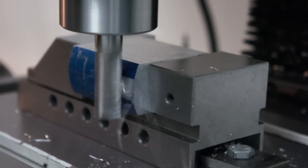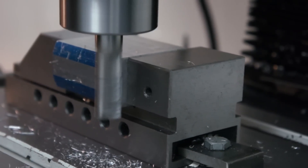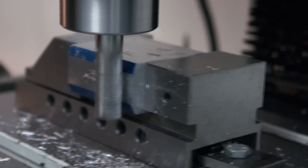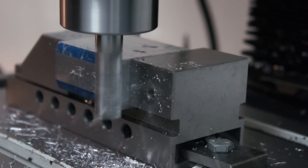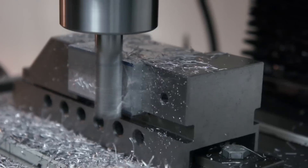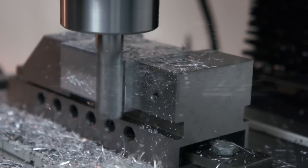The first thing I did was take some 2-inch round bar of aluminum. I didn't have square stock or rectangular stock of the appropriate size, so I cut it roughly with a hacksaw, then faced a few sides. Here I'm just finishing facing the last side to get the appropriate size material. All the milling was done with a 4-flute, generic half-inch end mill.